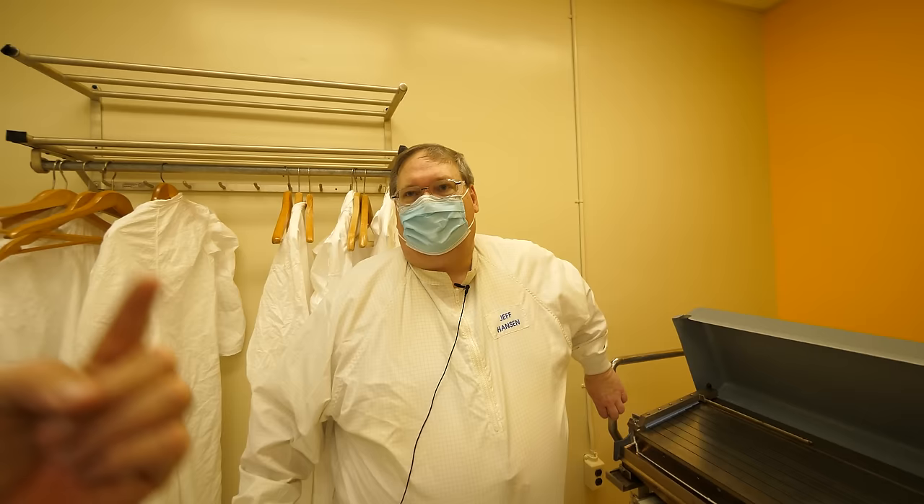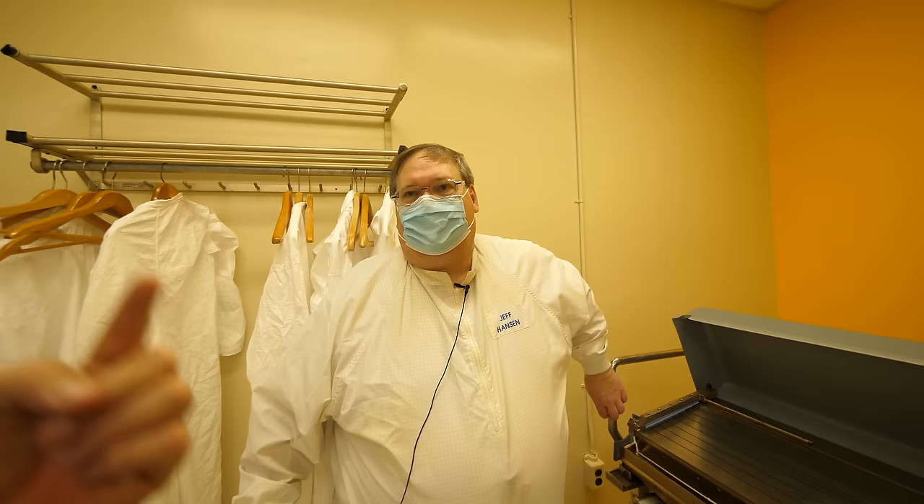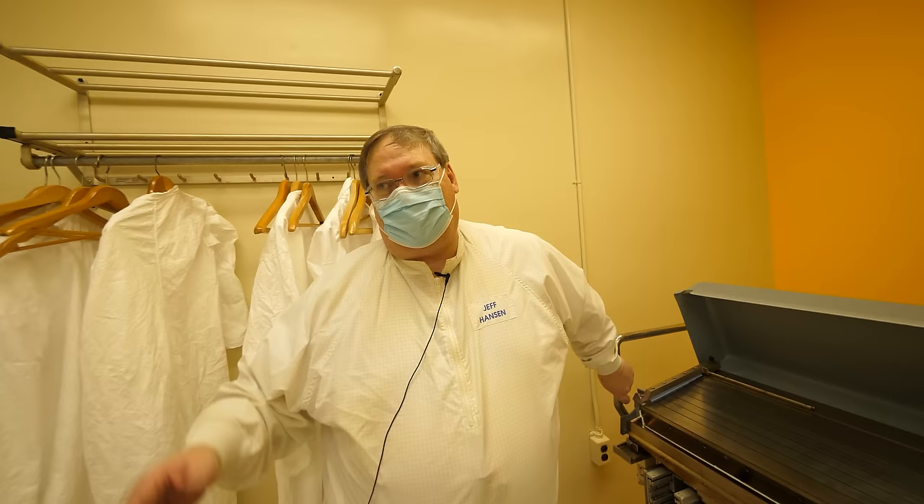Does the edge wire mix with the curtain? Jeff said the edge zone is going to be cut away anyway, so they don't worry about it. He then went to talk to the mechanical engineers about the hopper, and there are some incredible things about this design. For example, they had to control how parallel those bars stack up to within 50 millionths of an inch — an incredibly tight tolerance. There are tons of interesting fluid dynamics things to think about as well.